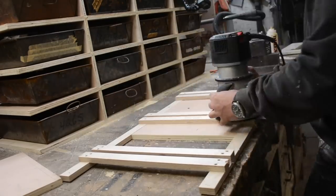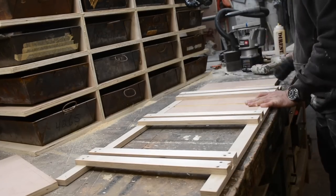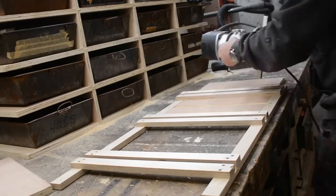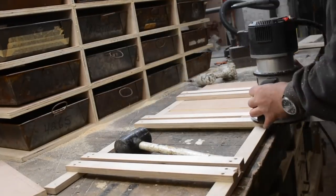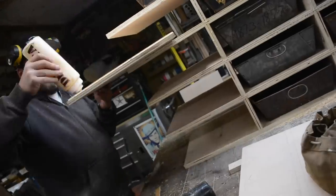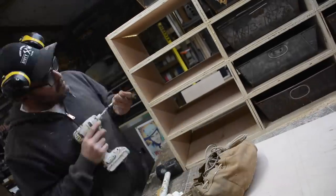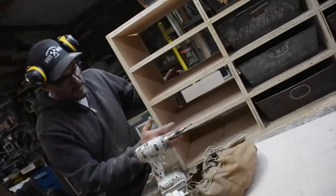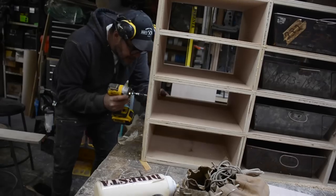I'm using the same jig I used to cut the sides, although it's not necessarily spaced accurately — I'm going to move the wood underneath each one of the different slots as I need them. I do this twice, just tapping the wood around and sliding it where I need to. Everything needs to be screwed to the table, otherwise you'll end up with a slot that comes off crooked. I put my one end on, screw it in place, and you can see how everything lines up nicely, then I do the other side as well.